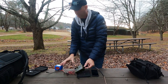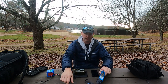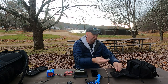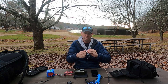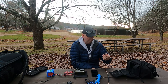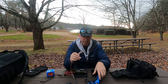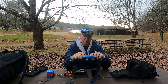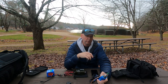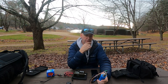The antenna is all hooked up and the batteries are good. I'm going to hook it up to the antenna analyzer to figure out what we get. Of course, in ham radio it's all about the connectors — got my trusty BNC female-to-male SO-239 adapter to connect to the analyzer. Going to try to operate just on 20 meters today.